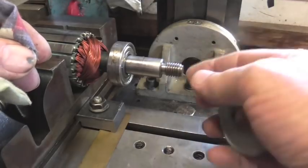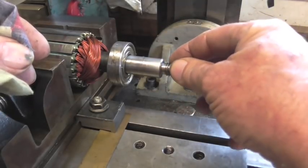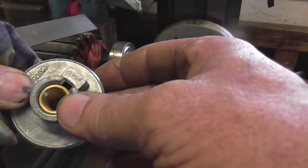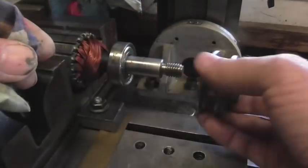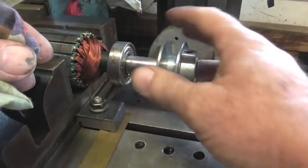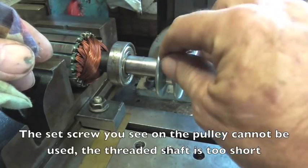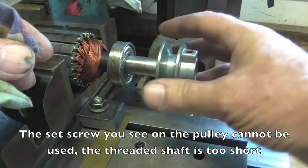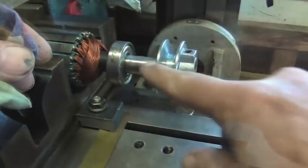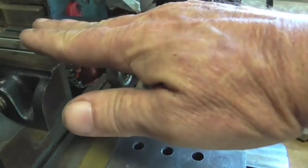This is part of a larger project, but I figured I'd do a separate video on making the machinist jack. This has half-13 left-hand threads. A customer brought me a pulley that had a larger inner diameter, so I had to make a bushing and thread it left-hand half-13, and it runs really, really true. For a casting, that's a pretty good pulley. But the customer decided he didn't want to use a set screw to lock it onto the shaft — he wants me to drill this out and put a roll pin. I've got some 3/16ths roll pins.